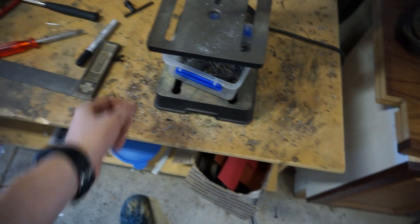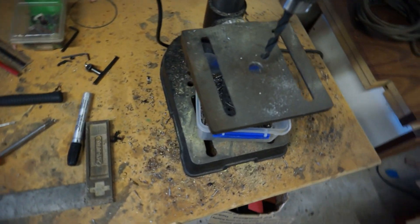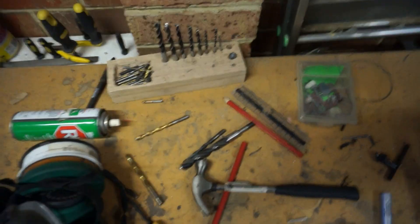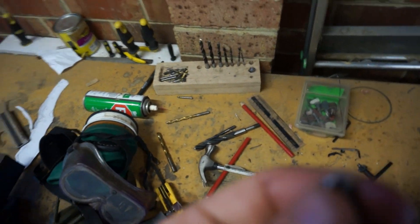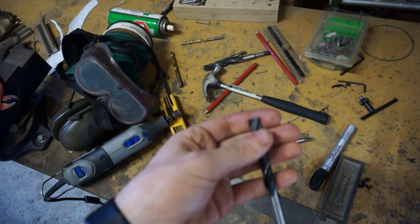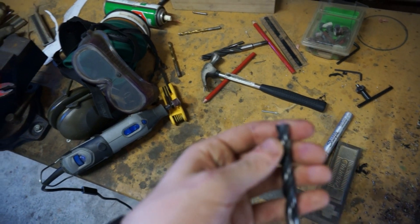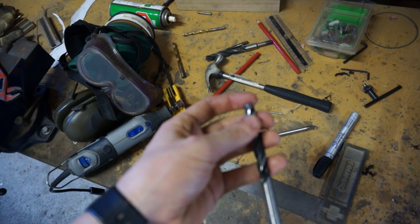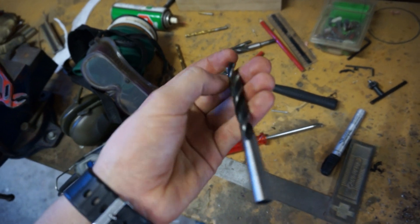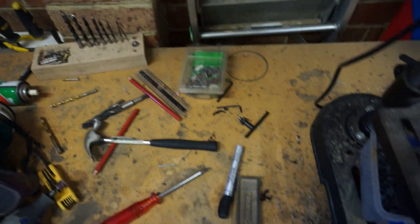There's a pile of drill shavings here. Maybe one day when I have enough I'll give them to a scrap metal dealer. For drill bits, what I actually use for countersinking is these point drill bits. I mark out where I want them, countersink, and then drill the hole through. It seems to work pretty great - probably better than just using a normal bit. I also use those for Kydex because they're easy to aim - they have a single point that grabs.